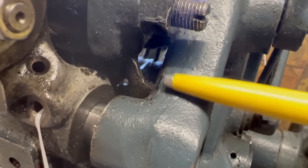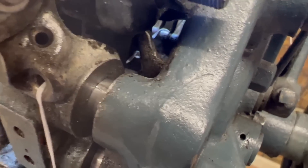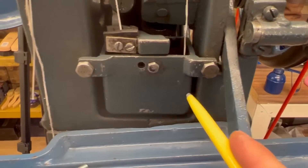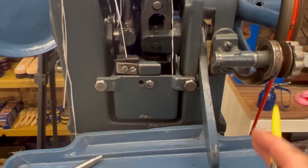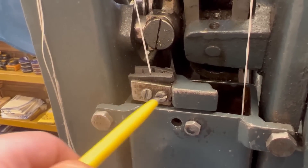Once past the brake - those two prongs - the thread has to come through a series of holes. These parts all move. Then it goes through what was originally a wax pot. When these machines first came out they used linen thread which needed to be waxed, as that's how a stitch locks in place tightly and is waterproof. Now we have pre-waxed polyester so there's no need for the wax, but the thread still runs around the wheels. These two screws are another way to adjust tension, and the thread goes up through not one but two tension wheels, then up through the middle of the looper and through the table bed.